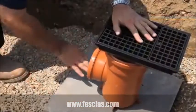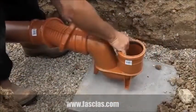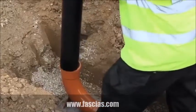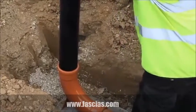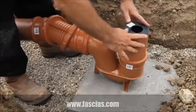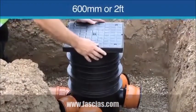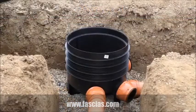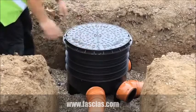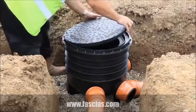Repeat the previous procedure for all the remaining fittings. Traps, bottle gullies and other available fittings can be added to the system. Soil and ventilation pipes connect straight into the long radius bend. Rainwater down pipes connect to the system via a universal rainwater adapter. Mini access chambers can be added up to a maximum height of 600 mm. Large inspection chambers can be up to 1.2 meters in height with a standard 450 mm frame and lid, and up to 3 meters using a 350 mm reduced access frame and lid.